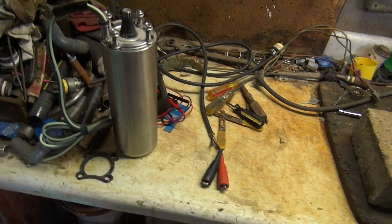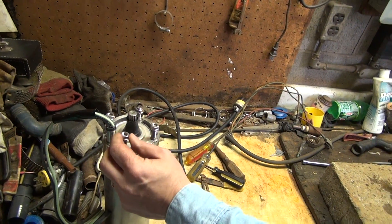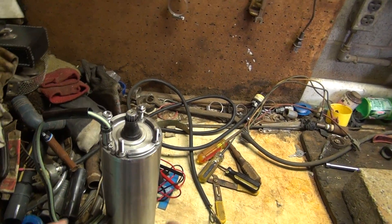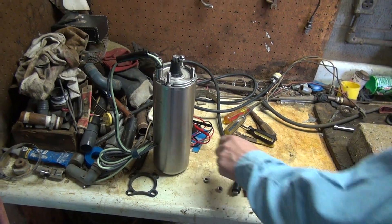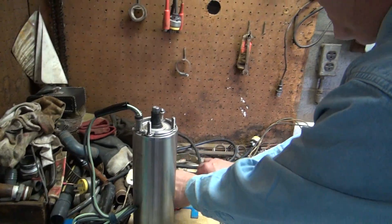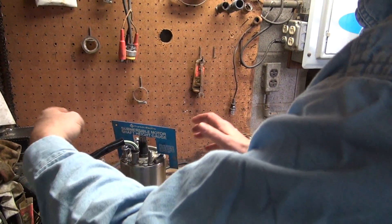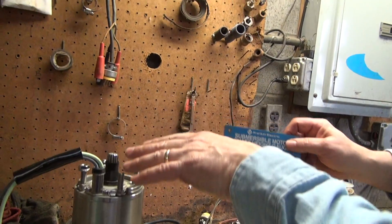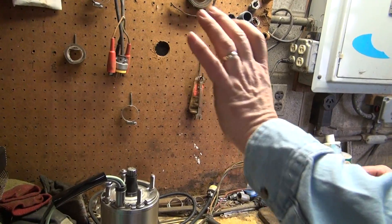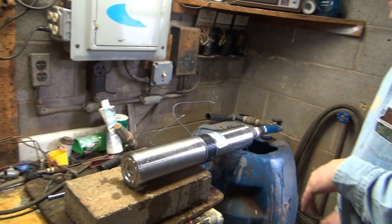Over here we have a pump that is just the motor, which we've torn apart so you can see it. You just have the four bolts that come off of there. This is the gear that connects to the pump impellers, and that's the pump shaft. We have a gauge — if we tear a pump up, there's a thrust bearing in the bottom. This gauge would tell us if the bearing is okay; it swings without catching. If it were to catch, that means the thrust bearing has dropped down, which can allow your impeller stack to drop down and cause problems.